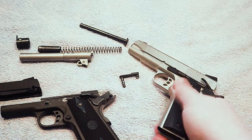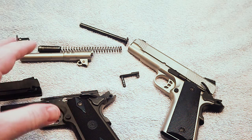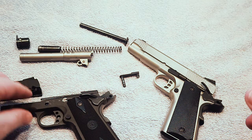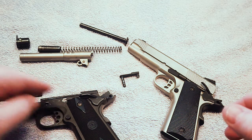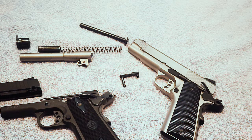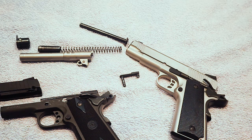This is my Taurus Commander size — I love this firearm, it is a great gun. But just remember: if you hear people talk about the reliability of a 1911 and why you need a break-in period, it is because of the way they are designed. To sum up — the way they are designed, combined with some of the imperfections in the machining process, means as those parts work together they basically polish themselves down to where they will run together and fit together more smoothly.